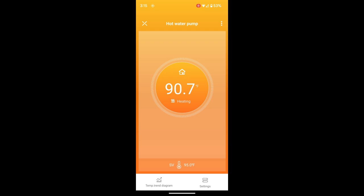That pump is now running and is going to try and rebuild that line up to the correct temperature. You'll see it drop and come back up once I turn that faucet back off. When I take a shower, it drops down to about 67 or 68 degrees, depending on outside temperature, because that's just straight cold water coming into the house from outside. One thing to note is that while this pump is running and you're taking your shower, it is pushing hot water like crazy to your faucet or to the shower. So just by adding this pump, the showers are so much nicer — as soon as you touch the temperature adjustment valve on your shower, it's instant hot water. It's actually really great.